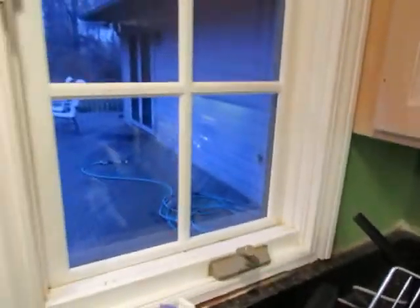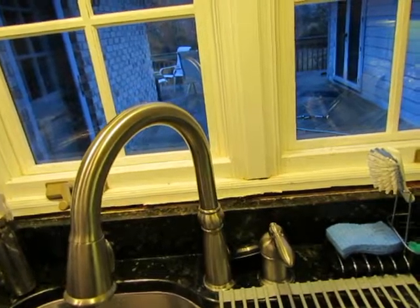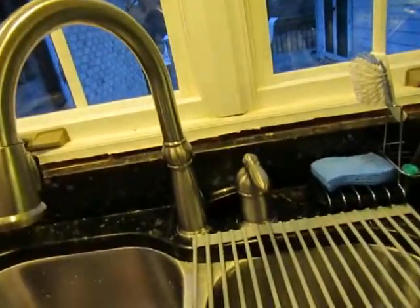One of the issues is there's no gap between the backsplash top and the wall, but as you traverse down there's a rather large gap between the backsplash and the wall. That gap might exceed the width of a tile, because ideally you want your tile to sit down on top of the backsplash.